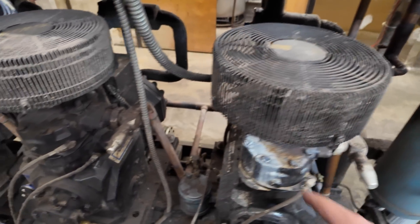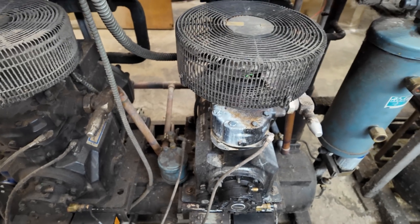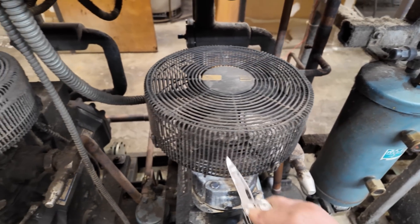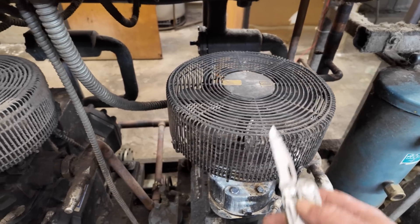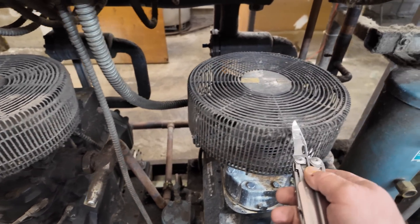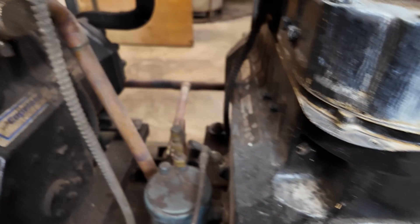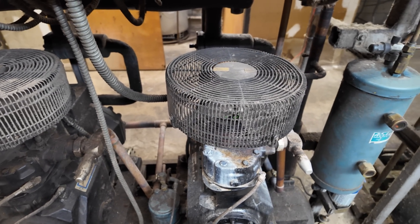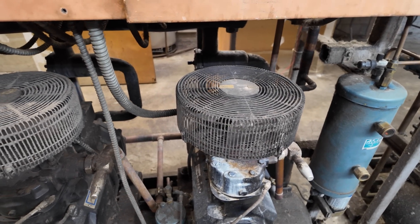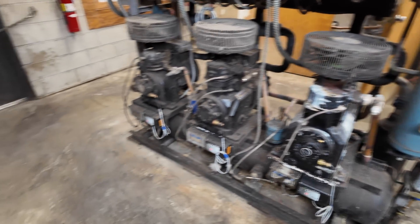You also notice here our head cooling fan — our head cooling fan here — which was just replaced March 24th, it's not spinning. It's not spinning. So something happened. Did that fan short or anything? Because these have a tendency to short sometimes. It looks like it is powered off of, possibly, a compressor — though not usually. Usually it's powered off of a step-down transformer. So we need to check that over really good.